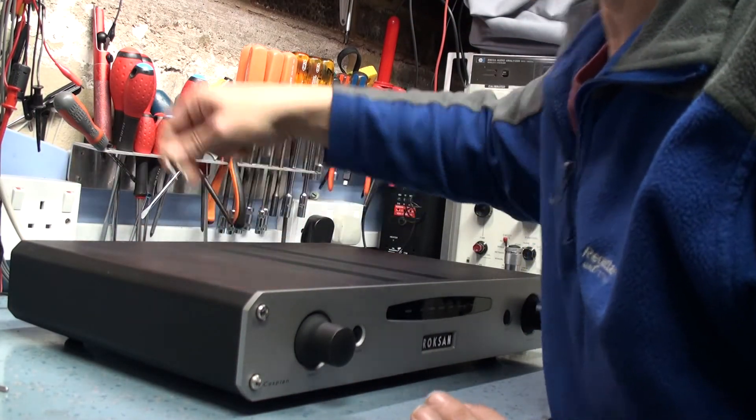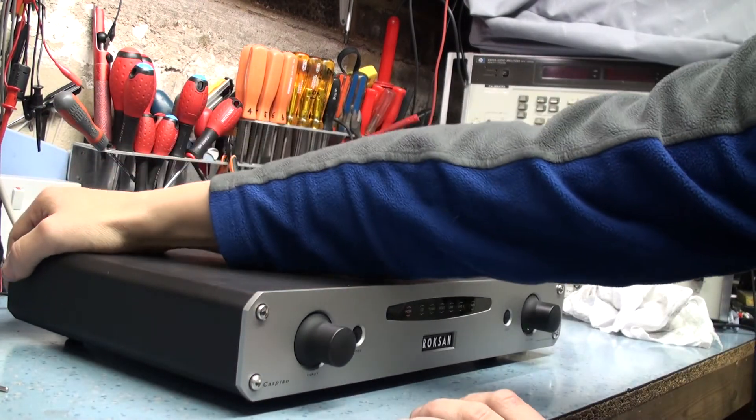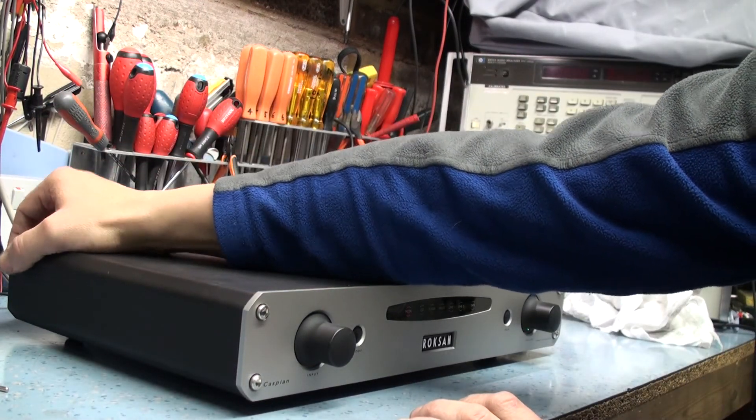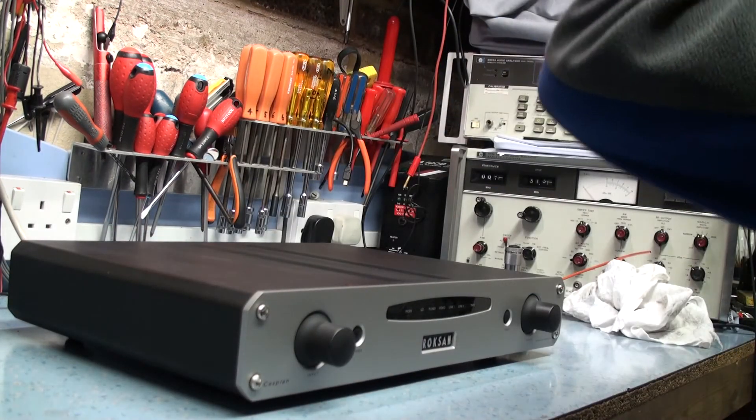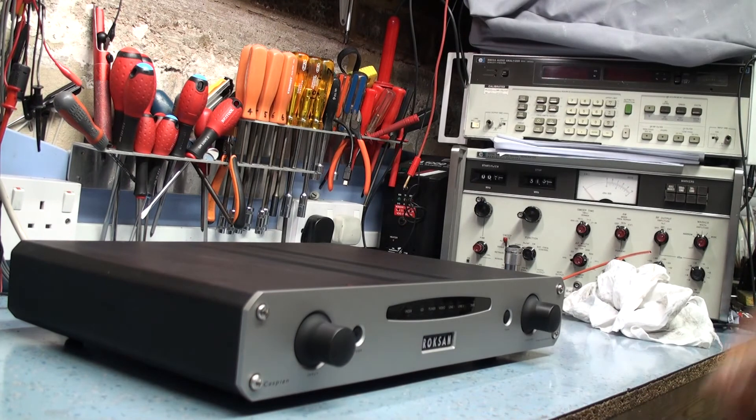What I'm going to do is take the power amp linkages out and re-power it up again. Definitely don't like that — that sounds a bit like DC to me. So I think what we'll do is whip the cover off and have a look inside to see if we can see anything obviously like a dry joint. It sounds like something, as it's getting warm, is starting to fail. It could be the output transistors aren't soldered in properly, or it could be a dying capacitor. But until we get the cover off, we won't know.